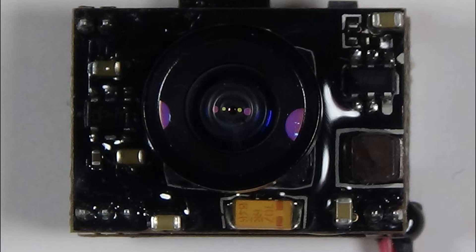White stripes are an indicator that the LC filter has a problem, and the camera getting hot exactly where the inductor is placed is another hint. So I first measured across the inductor with my multimeter and sure enough it showed 25 ohms — way too much for an inductor which should have a very low resistance of about 0.5 ohm. Seems the culprit was found.